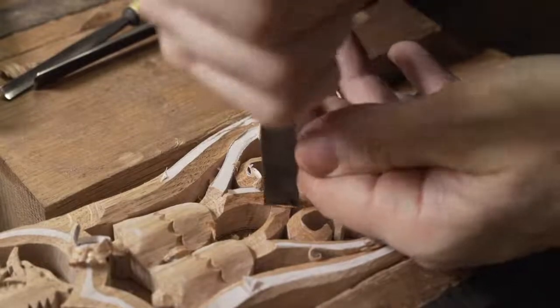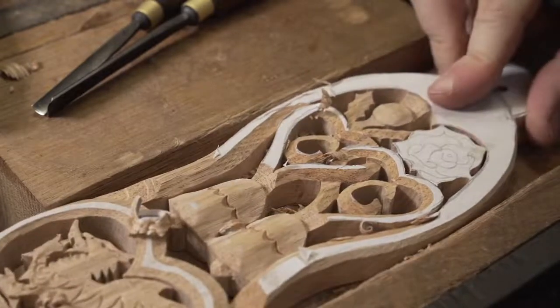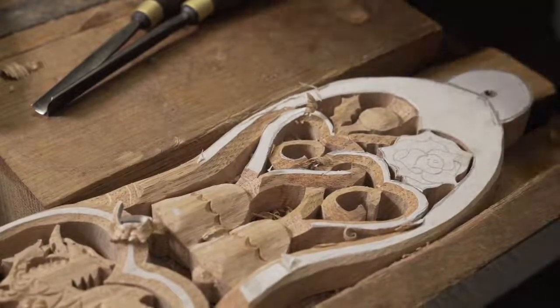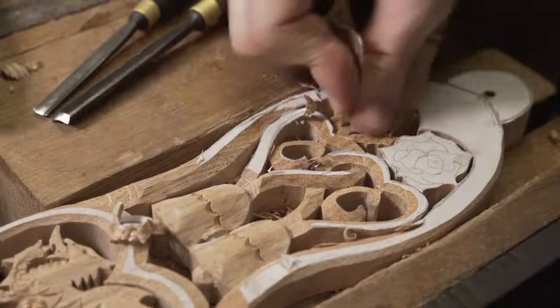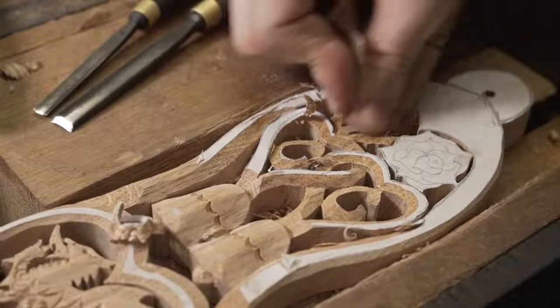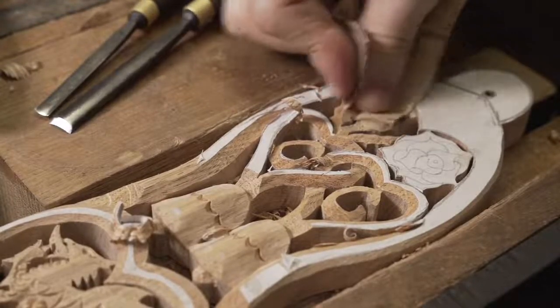That reduces the amount that we have to take off on the belt sander afterwards. Again, you shouldn't do that bit that I did there. You should turn it round in the vise and cut the other way. And that is basically the only time that you will have any sort of injuries. The only other occasion is if something slips in the vise.